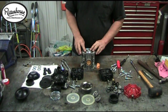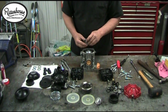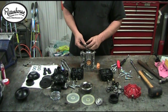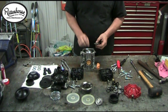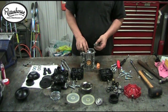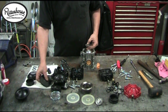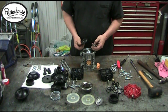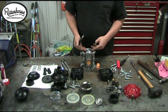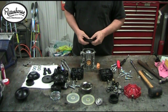Also check the threads where the bolts and retainer washer are — take a look and see if the threads are busted out. If the threads are busted out, it will probably pull your diaphragms a little snugger and stretch them more, causing premature breakdown. If it's to that point, I normally recommend just buying a new pump, because by the time you tear it down and buy all the seals to rebuild it, the cost is probably halfway to the cost of a new pump.